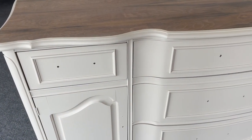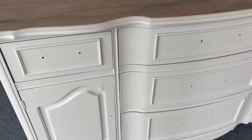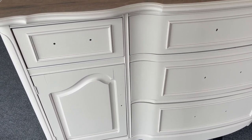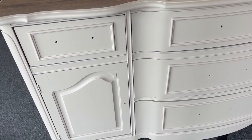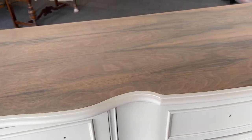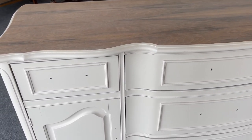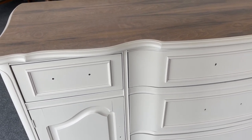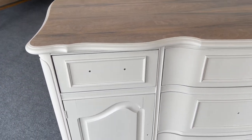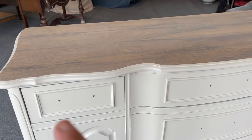Sometimes you need to touch up because when I was sanding I accidentally dipped my sander a little bit and hit the edge, taking a little bit of paint off. That's another reason you sometimes need to go around with a touch up brush — not a big deal. I would much rather do that than freshly stain or wash something and then either have to wait or tape it off. Also worth noting: Fusion mineral paint has a built-in top coat and does not require an additional top coat. I do not top coat all of my Fusion pieces. This is a very light color almost like a white, and I tend not to want to top coat my whites because they can yellow the color. So I'm going to top coat the entire top before I do my touch-up paint on the trim, because Fusion has a very matte finish and my top coat is satin — I don't want satin trim and a matte finish on the rest of the piece.